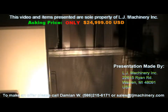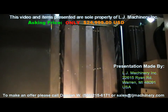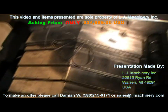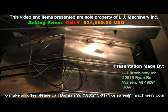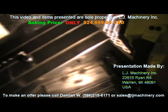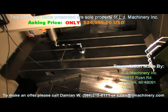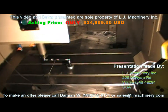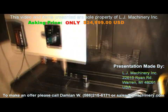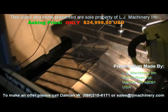All the way covers that needed fixing, we fixed. The wipers are in very nice shape, and I can tell you why — because this machine mostly ran fiberglass. That's why the ball bar test results are great and the backlash on this machine is beautiful. I'll show it to you after the ball bar test, which I'm going to run with you on the video.